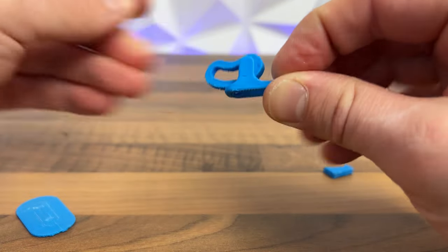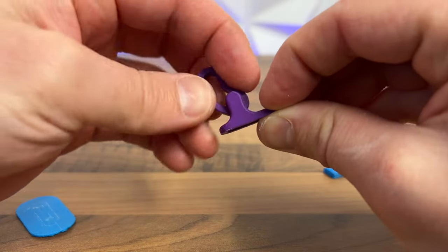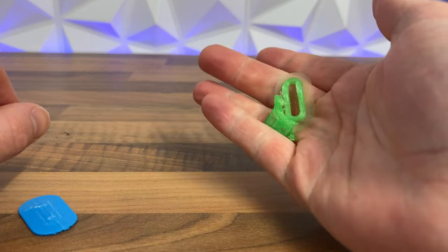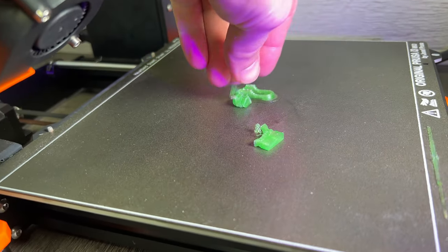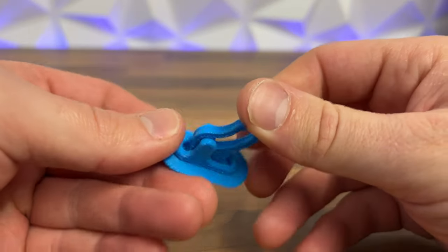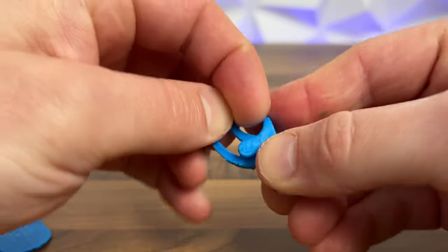Here's the result — the raft just pops off nicely, as do the pre-made supports. I did have to cut a millimeter off the edge of the supports as it had squished a bit too much, but the whole thing just works. Comparing to the other two printers: the Bambu Lab did it lightning quick in about 14 minutes with really nice quality. The Prusa just didn't work — I'm not slamming it at all, it's arguably still my favorite printer, but this proves a great point: no matter how much you spend, sometimes it still won't go as planned. The EZ3D missed a few tiny bits in the layers and there's a bit of stringing, but this really isn't an easy model to print — there are 45-degree angles, overhangs, tight gaps — and this has done a good job.